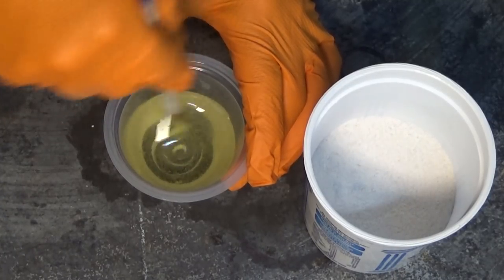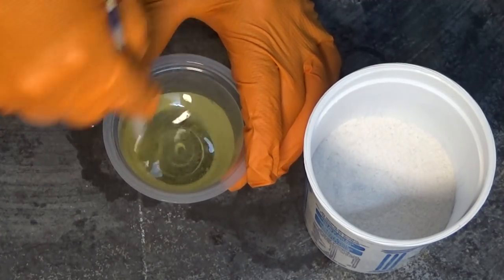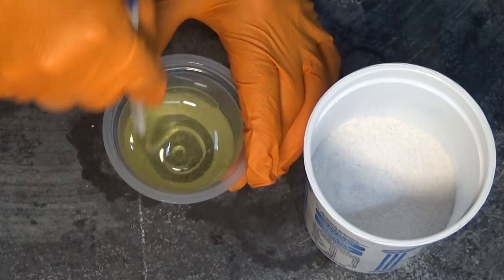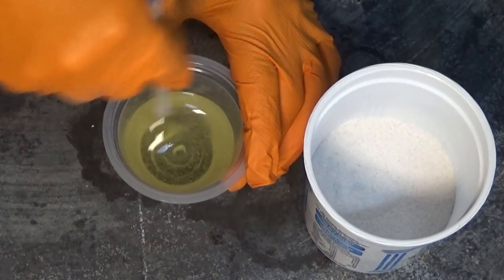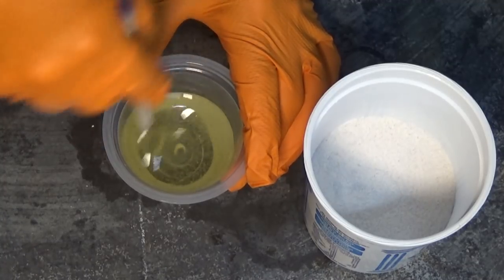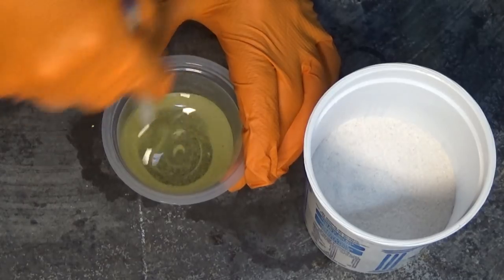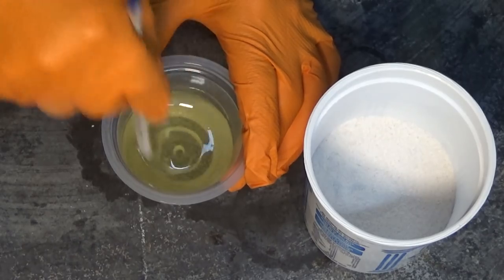And I don't think you want too much epoxy because it's going to generate a lot of smoke and gas when the hot metal hits it. So this is more of a binder. Its job is simply to hold the sand crystals together, not to totally exclude the airspace between the sand. We want air in the mix because that's going to allow any gases to escape into the surrounding green sand mold. This little mold that I'm making is going to be put into a flask and rammed down with normal green sand as well. So we do want the gases to be able to escape.